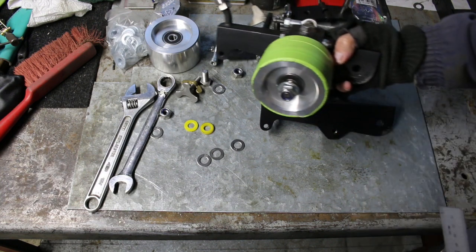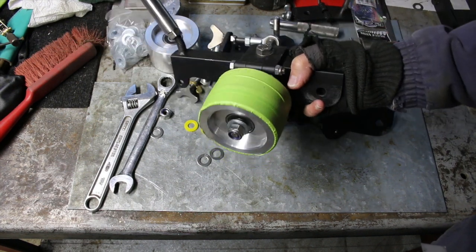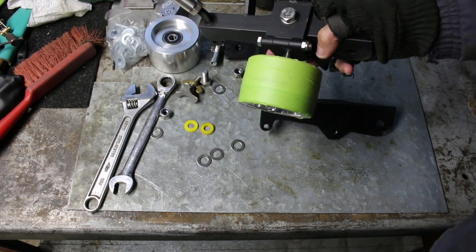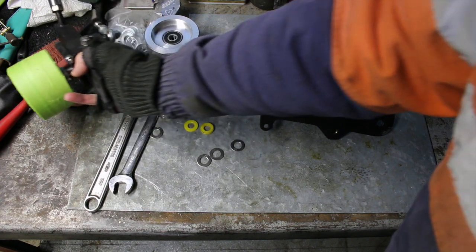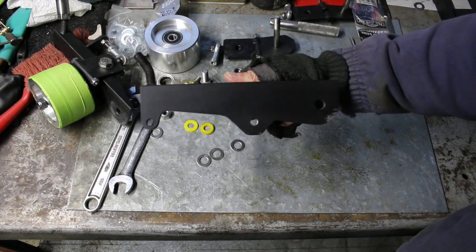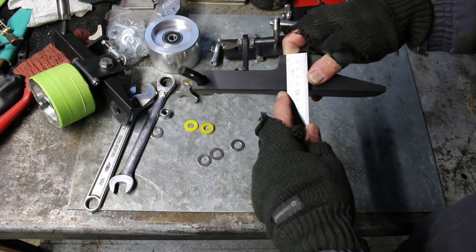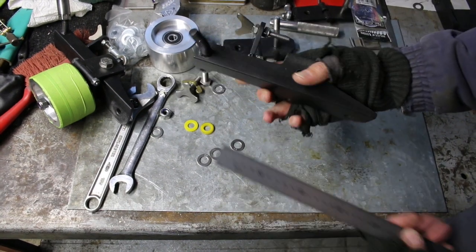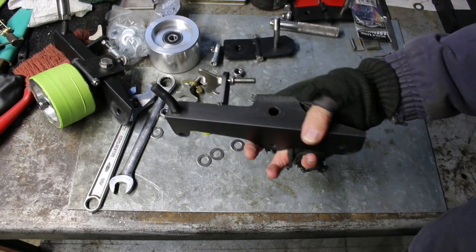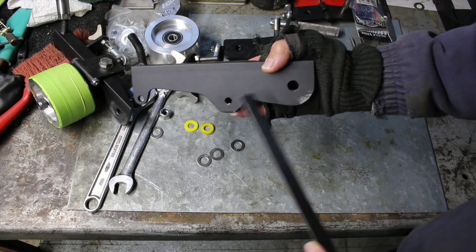So those are the parts, pretty much, and here's one assembled up, another one. You've got your hinge and your wheel — your wheel's taped up because it's new. Like I said, I'm running a 4-inch tracking wheel. I tend to make them about 65mm wide, just so I've got a bit of room for the belt to move around on. You can see on the other model over there — the prototype — that I made the main arm up out of bits of offcut stainless I had. What I've gone to here is mild steel angle iron, which would have been about 65 or 70 by 50. I've shaped it up into what I want — about 230-something millimetres long. Down the bottom, this is where it fixes to the machine on a bit of 40 by 40 box.